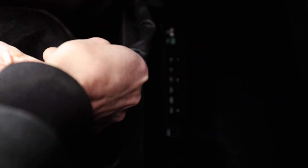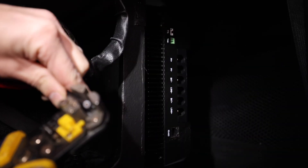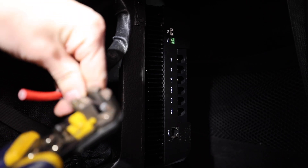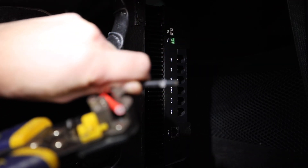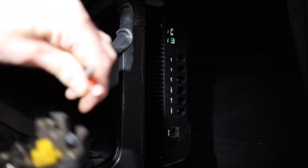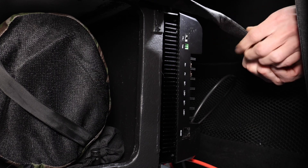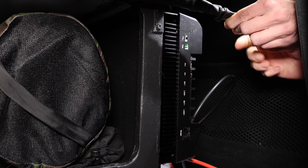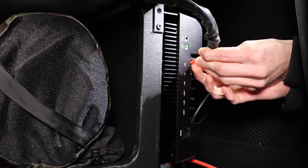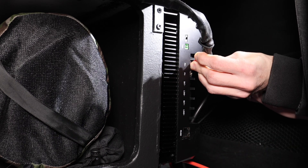Here is a spot where you could potentially damage your solar panel and cause a fire. Make sure your solar panel is unplugged at the solar panel, especially if you're outside and the sun is out, because the wires will be hot — at least the positive one. I'm going to strip these wires and get them prepared to attach inside the solar controller. Loosen up the wire entry points, give the wire ends a nice tight twist, insert them, tighten down, and give a friendly tug to make sure it's a secure connection.